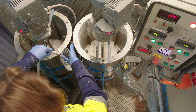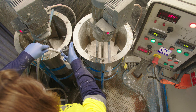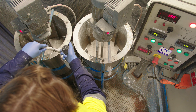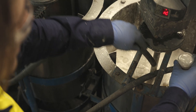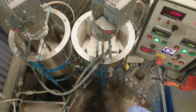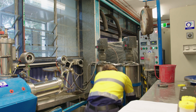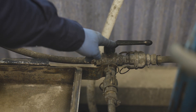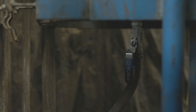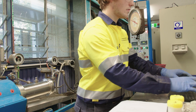When tank A is half empty, use a stopwatch to take a Massey sample. Record the time it takes to fill the cup and the slurry specific gravity. Empty the sample back into tank B — this is the mill discharge. When tank A is 3 quarters empty, take a particle size sample using the test tube. Take care not to overfill the tube as this could bias results. Best practice is to sample across one pulsation of the pump. After tank A empties, simultaneously stop the timer and the mill shaft. Change the flow redirection valve back to recirculation and swap both valves underneath the tanks. The flow redirection valve needs to be changed to stop feeding the mill on standby, while the tank valves need to be changed to stop the pump from running dry. Record the time, the power draw and the mill discharge temperature at the end of the pass.